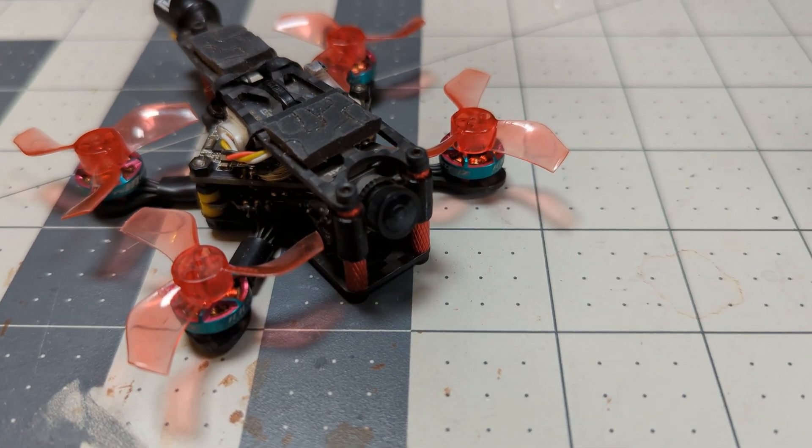The important part is the video system, because I wanted this one to be digital even though it sat in the same frame as what analog is designed for. I really had two choices — DJI is just too heavy for something 75 millimeters. It was either going to be the HD Zero whoop light or the Walksnail 1S nano kit. I decided I wanted the 8 gigabytes of onboard 1080p recording offered by the Walksnail system, so I went with the 1S Avatar Walksnail kit from Caddx with their nano camera V1.